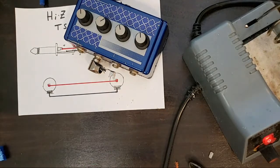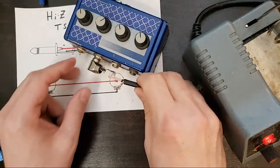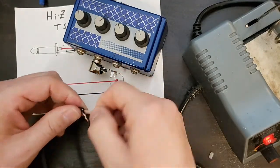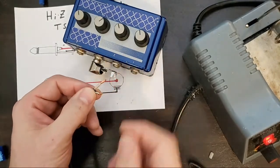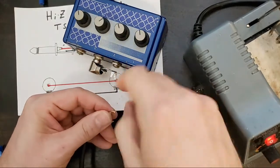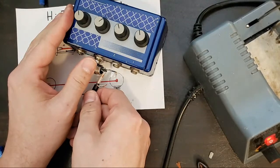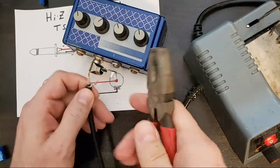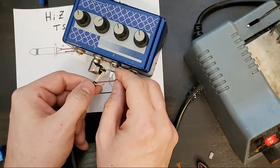Mem is in the house as well. Mem asks, is Frank anti-stripper? That is, wire stripper. And, you know, I've owned wire strippers, but I've never owned a great pair of wire strippers. I would love to try a pair of thermal strippers, which I think is a super pro way to strip wires. So this is gonna be a little too long. I'm gonna trim off just a hair before I go any further. So not ever shelling out the $200 to $400 for a pair of thermal wire strippers. I don't have a great informed opinion about most strippers, but I have used the cheap flat strippers that kind of look like this, and they nick your wires. Like you could strip wires with this or the big flat ones, but in my experience, they'll nick a few wires, and that's not an ideal scenario for cable making.